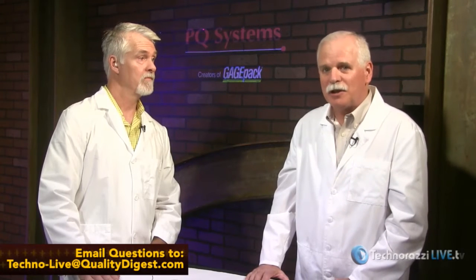So how do we deal with this? The viewer that wrote this in has done his homework. I've followed his different emails, and we've corresponded back and forth. What would you do? First thing you would do is write a process to cover the range and how you're going to validate and make sure this actually works. Then you have to document it and do repeated tests. You have to make sure your quality manual allows you, the customer, to perform non-standard tests. Not uncommon, very common. There's always special applications, but what does your quality manual say you have to do? So that has to be covered.